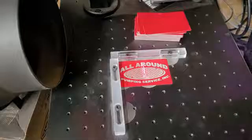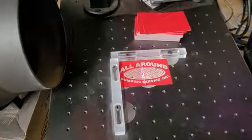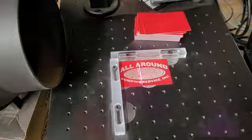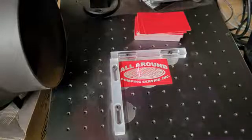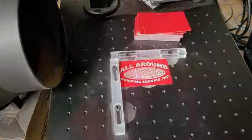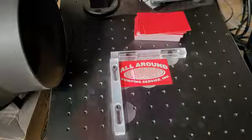You can tell how low the power setting is by how quiet it is. My main burn is also on a pretty low power setting — not as low as this. I believe my main burn is 35%, which is really low. But running lines as tight as the ones I'm running, you kind of need it low.